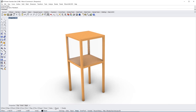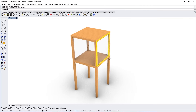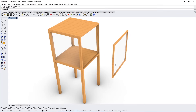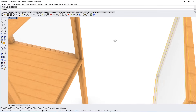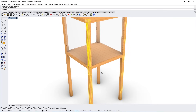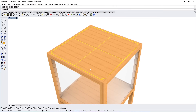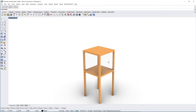I'm going to go with the clear plastic cube motif but make the walls double. Here is the design I've come up with — you can see the door which just pulls out and pushes back into place, and there are two panes of polycarbonate with an air gap between them. I can make all the uprights and cross members out of 2x4 lumber, and the top panels out of Luan — a really cheap, thin plywood. You could build the whole framing for maybe $20.